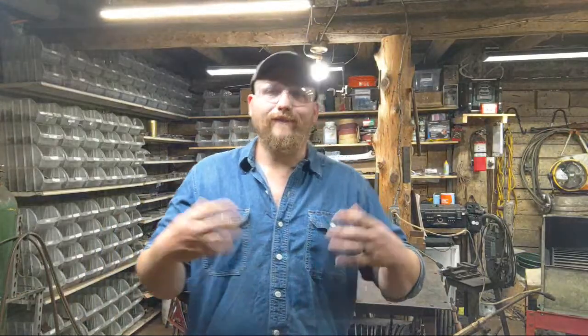And so you'll see people grinding on a stone wheel and the thing's running at 7,000 RPMs and they're just sitting there grinding away on something. Their shop, their rules, but you'd never see me standing anywhere near it or around it. If they take a guard off, if it came with a guard to begin with, it is there for a dang good reason. Now, if you have to start adapting and modifying things to such a degree that it becomes unsafe in order for you to get your job done, then you're using the wrong tool for the job. So that is just my thoughts when it comes to safety.